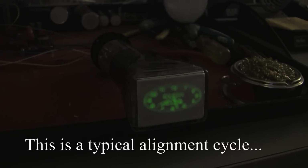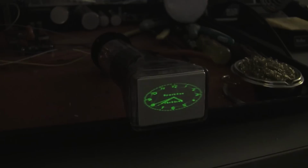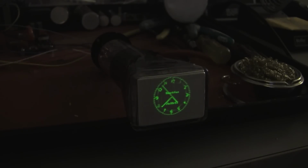Focus. Alright, can make that a bit more round, make it taller, the vertical size, make it taller, and the position, oops, it's touchy. Alrighty. Touch up the horizontal size to make it round. It's pretty good. Horizontal position's pretty good. A little more focus adjustment. Astigmatism control.